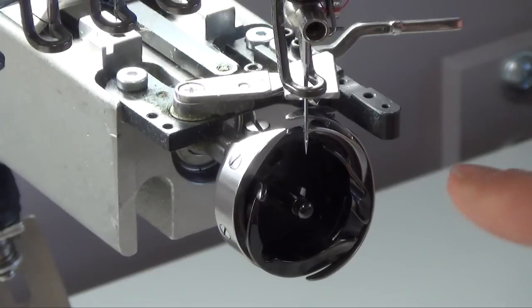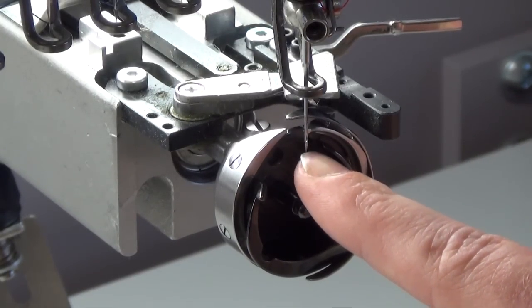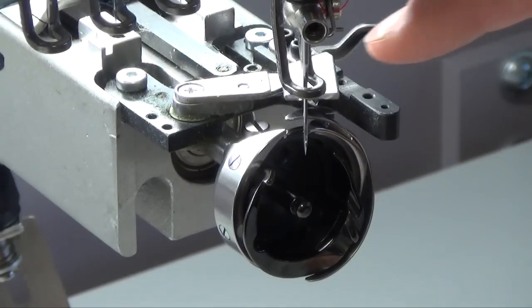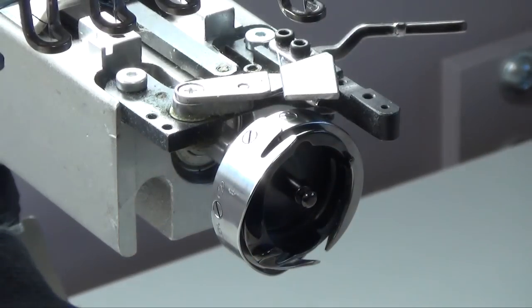Another possibility to test is to take your finger and press the needle on the peak — it should shake just a little bit. After that, rotate the main shaft again to reach the second screw and fix it also. The second screw has to be tightened, but unfortunately it is in an unreachable position on top. In this situation, release the main shaft brake again, rotate the main shaft until you can reach the second screw more easily, switch on the main shaft brake, and tighten the screw.